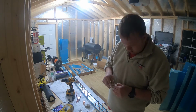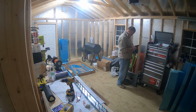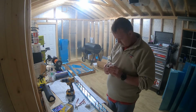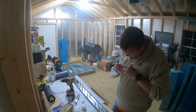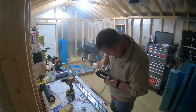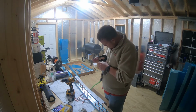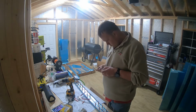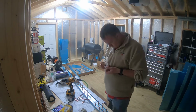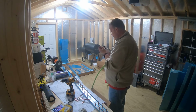So here I'm using a pneumatic rivet squeezer. The traditional way of handling rivets was using a pneumatic air gun, which had a hammering motion, and then you had to buck the rivet. It was very hard to do with one hand. So this tool allows you to hold the part in one hand and squeeze the rivet to its final size with the other. The only downside is that you have to get the rivet squeezer adjusted just right. So what you see me doing here is squeezing the rivet and testing it to make sure that it's squeezed properly. If it's under squeezed, I keep adjusting that pneumatic squeezer just a little bit further until it tests properly. And then I squeeze all the rivets around this hinge with a bearing in it.